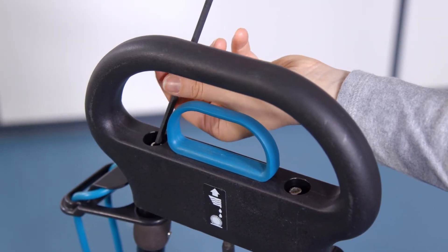The on/off control is at the back of the machine — by pressing the foot pedal lightly and pulling back the handle, the motor will start. The solution discharge control is situated on top of the handle. The motor overload button is situated at the rear of the machine, just above the foot pedal.